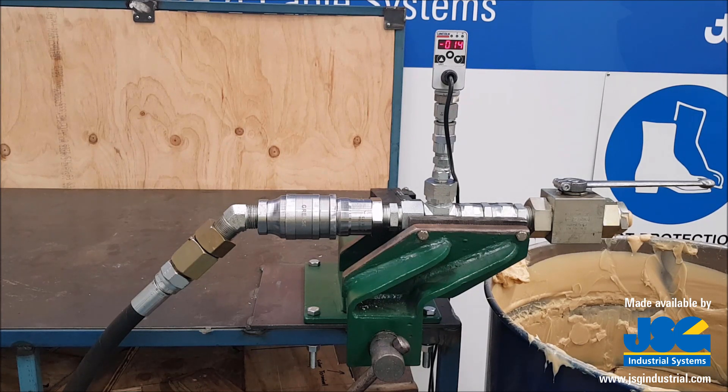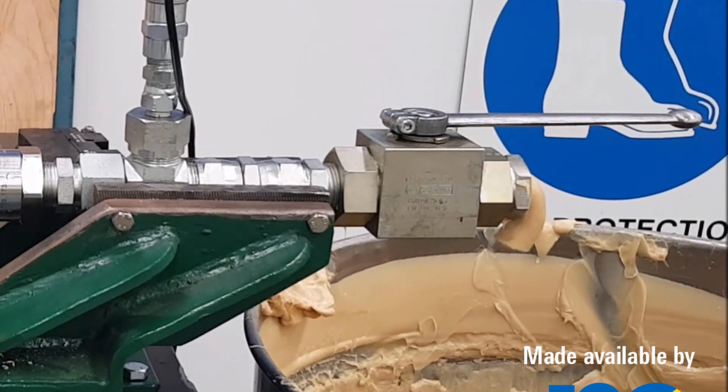I am now off to turn on the pump, but it is very important that you run grease through the connection to ensure that there is no air trapped in the system. You will initially see a little bit of grease come out, then the full flow.